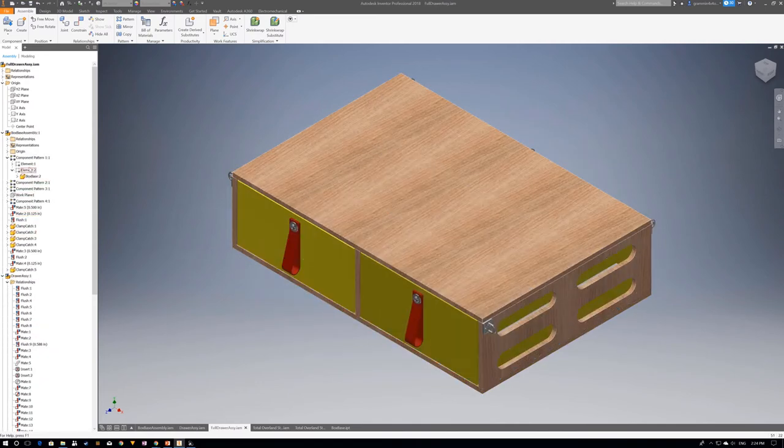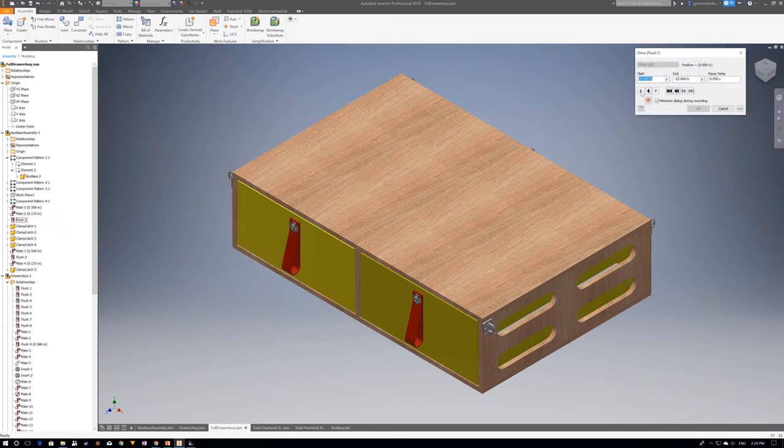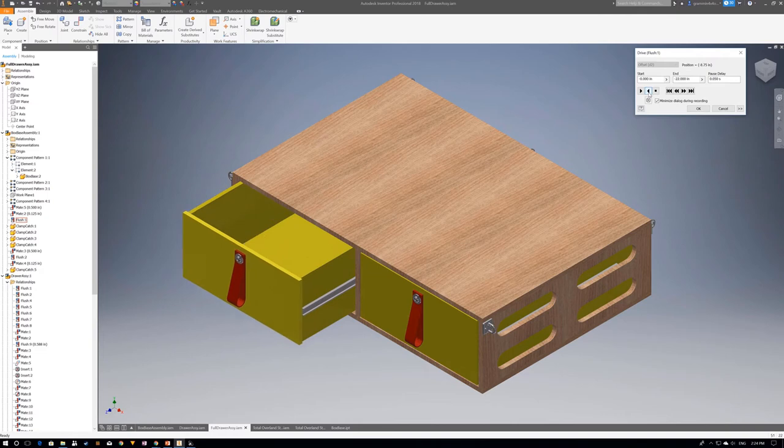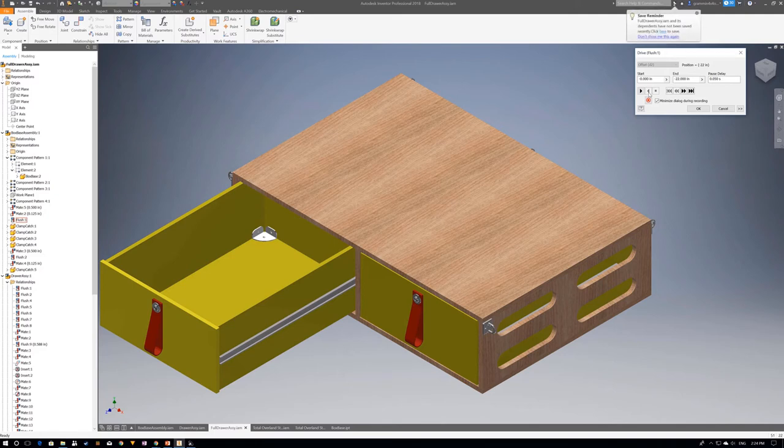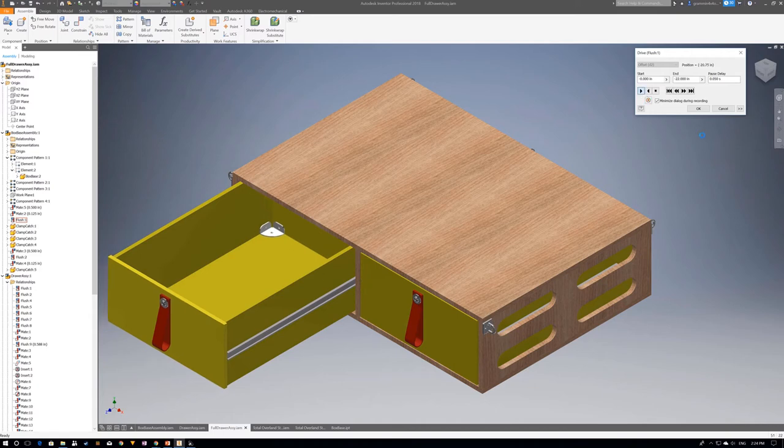Here is the full assembly, and I can show a nice animation of the drawers opening and closing. The 22-inch slide is a full-extension slide, so it comes out the full 22 inches. If I set them at the right depth, I'll only have five inches of overhang at the back, and I think that's fine — because with a fair load in the drawer, if it does bend slightly you want it to catch on the back before it tips over.